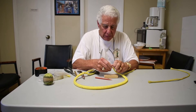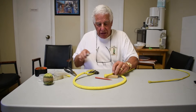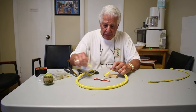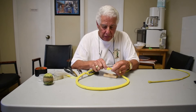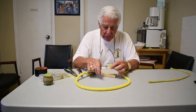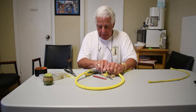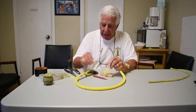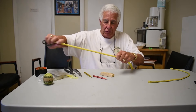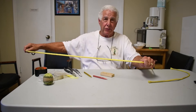Hold them out and tuck them off. Then do a couple more, a little further down the line. Now we go here and smooth all this back down — and voilà, we have a tapered splice.